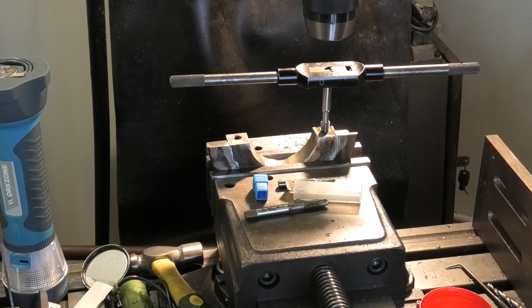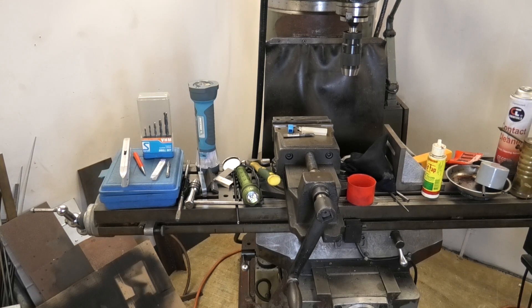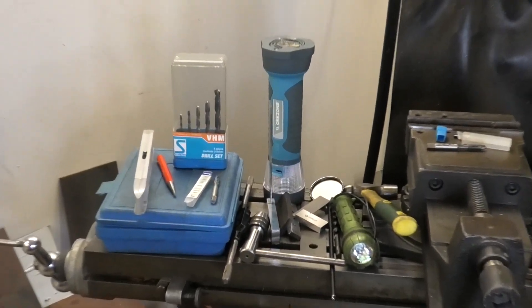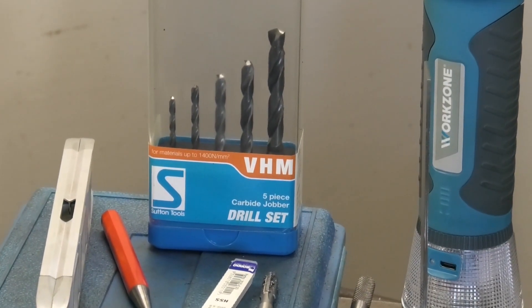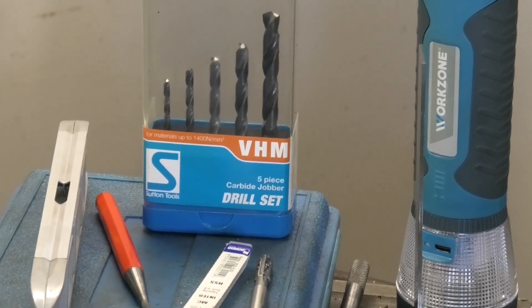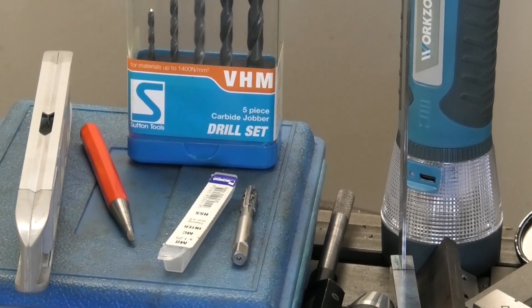Please like and subscribe. Job was successful. Just showing you a lineup of the tools that we used to get the job done - quite an assortment. A little carbide bar that we went down with first, to set the centre for the drill. Once again the carbide drill from Sutton. We drilled about 85% of the way down through the tap, and then I used that little punch to bang the bottom of the tap out - it just fell away quite easily.